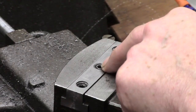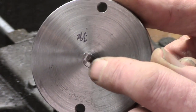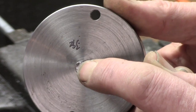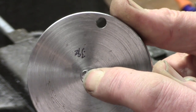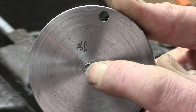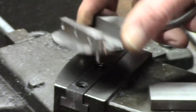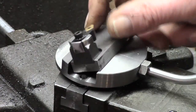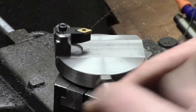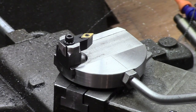Another option that might be tried is to take out the bearing at the bottom and then shorten this down, and drill and tap for a small bolt, and have a washer in the pocket that the bearing was in, and tighten that down so that it's really tight against the T-nut. So I may try that. And of course I've got to do something else for the tooling on here, which might be some HSS.